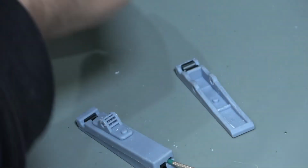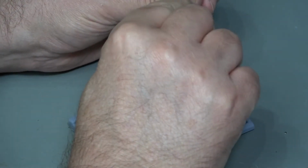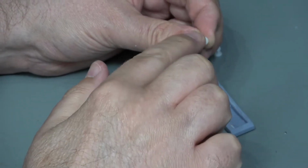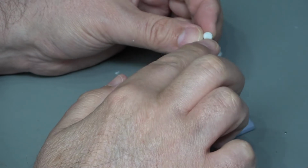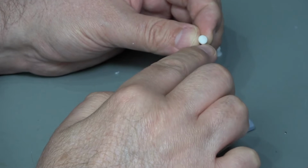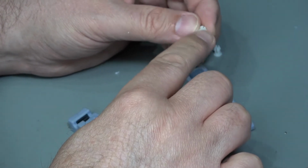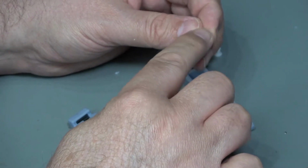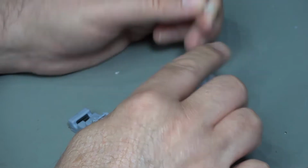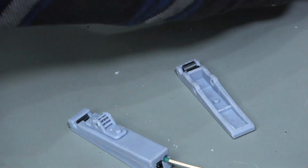And the reason it's not doing so is because of the manufacturing method. This is built on a build plate, and that face just there sits on the build plate. Now the first layers of the resin get extra exposure, so they stick to the build plate tightly. But what that does is it causes the light to diffuse around it a little bit, the ultraviolet light that sets the resin, and widens the component at that point. Now I had compensated for that, but not enough, evidently.